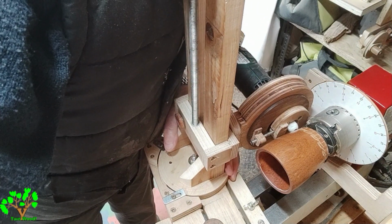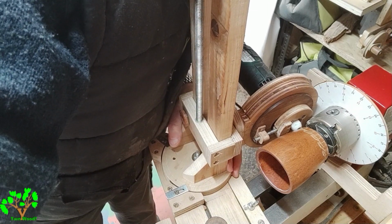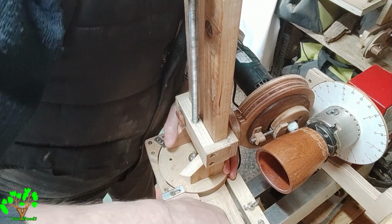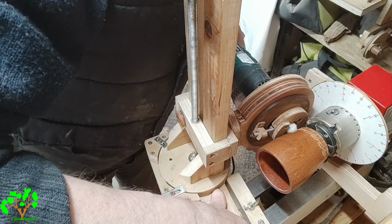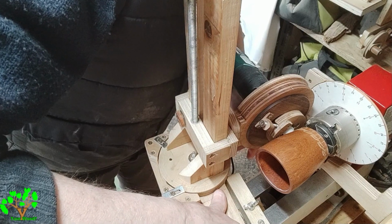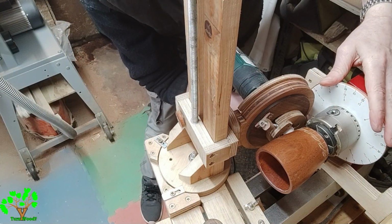Now I'm engraving the circumference of the cup. I have to be careful that the movement of the annulus isn't too great so that the cutter comes away from the wood. So I have to restrict the actual engraving design to quite small amplitudes.